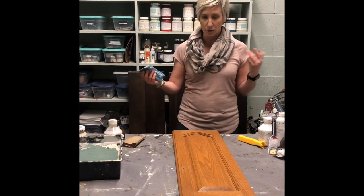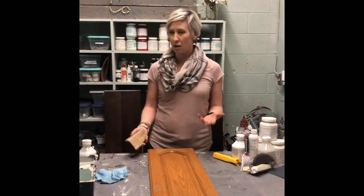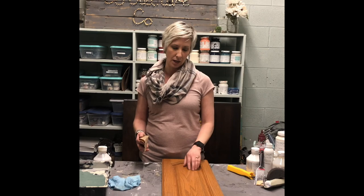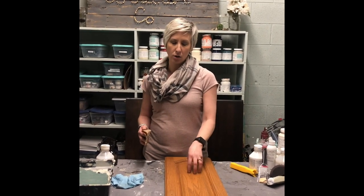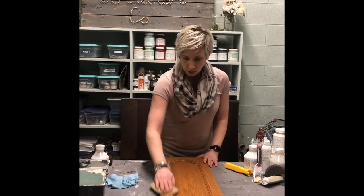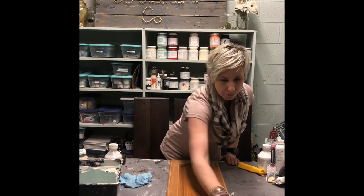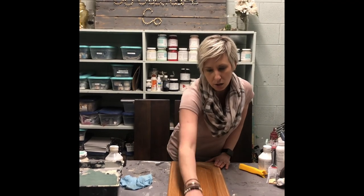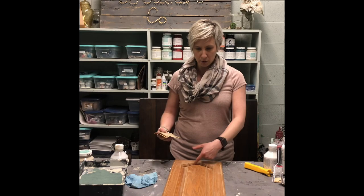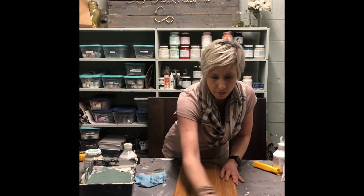So cleaning with TSP is a very, very important step — make sure you take the time to do that. Once it's all clean you are ready to give it a light scuff. You will get some sandpaper in the kit. You don't have to scuff through all the varnish. Basically what you're doing is roughing up the top surface to make places for the paint to adhere really well, so the primer can grip to the open surfaces, but you don't have to take the varnish off completely. Always go with the direction of the grain. I'm not too worried about getting sandpaper in the grooves because where chips happen are on the raised surfaces, so that's where I want to concentrate.